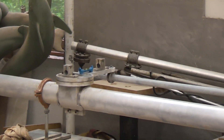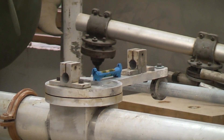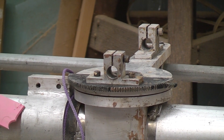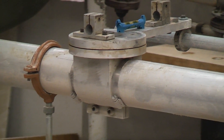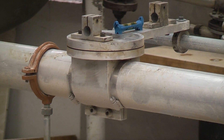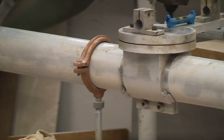I use a level and try to level each of the pointer assemblies as best as possible — there's one down here too. Once they're level, the pointer bars themselves will not be off; we want those to be in line as well, though we can adjust that later if needed. I've added a couple of C-clamps or pipe clamps on either side so that if I have to loosen and adjust them, I won't have to worry about the trammel points at that point. The boom holding the pointers will be up in the air, and I'll be able to adjust it with the hose clamps. The orange clamps are just to support the boom while I'm trying to level it.